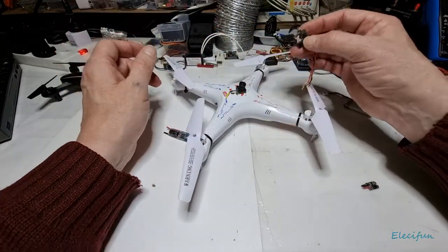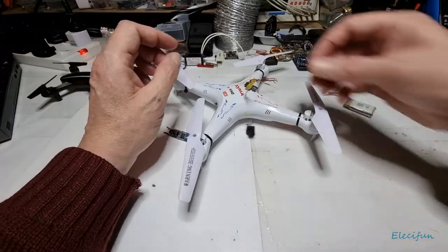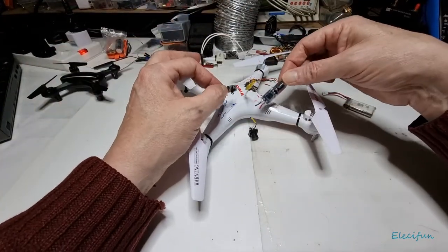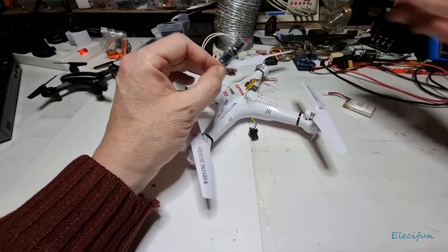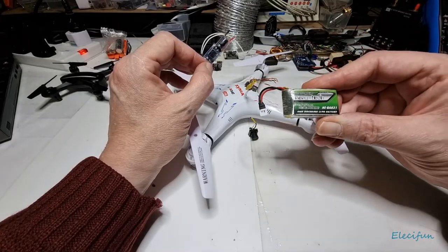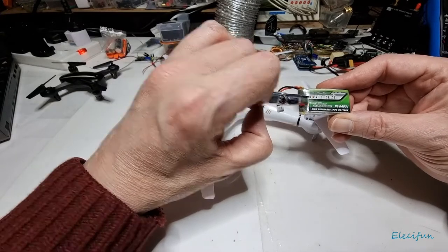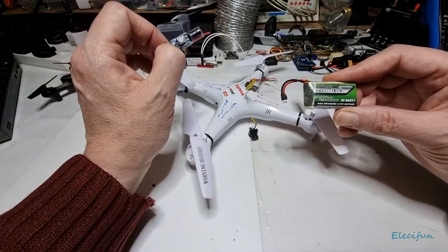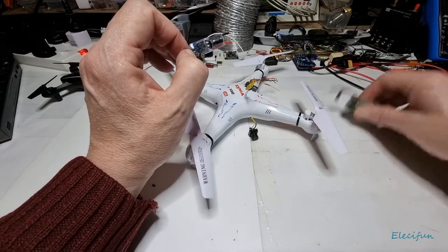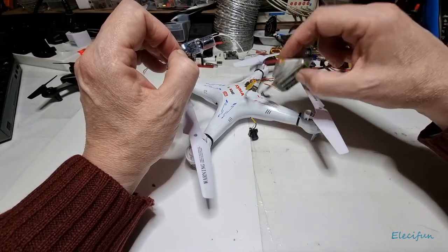So we've got our camera, our transmitter, our step-up boost converter, and our main filter to filter the battery. We're not going to use the stock batteries — we're going to use these Nanotech batteries, which at the same capacity — 750mAh — have a 34-70C discharge rating. There's only a gram difference in weight and no real physical difference, so it fits in here quite nicely.